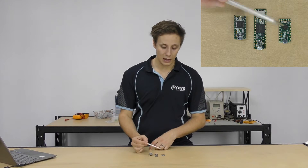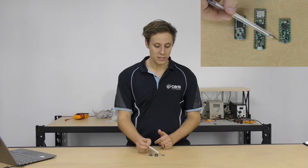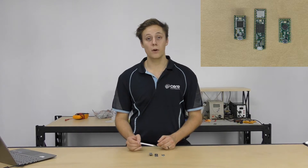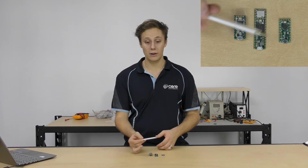For $24, you get an ARM Cortex M0+ processor running at 48 megahertz, 27 in/out pins all broken out onto headers, 62K of flash and 8K of RAM. Now, the pin voltage on the LC is 3.3 volts. The 3.2 and the 3.5 are 5-volt compatible — their system runs on 3.3 volts, but if you accidentally input 5 volts to one of the pins it won't destroy or damage your chip. The LC doesn't have that functionality, but there's still a huge amount of horsepower in this board.